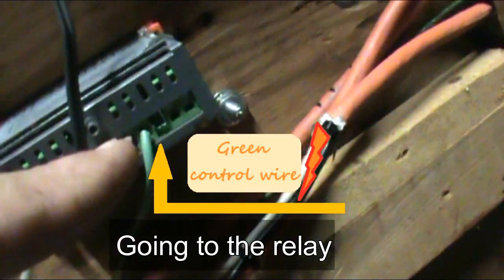This bottom one is the power wire coming in from the receptacle. That one there is the control wire. The way I have this wired up, your hots all are together and go to the bottom of this switch. Out of this switch, the hot goes over here to the power wire side. Then this is your common right here. Comes up here and all the commons are hooked together. These are not commons — these are hots. When this main switch is on, it gives power to both the controller and over here.